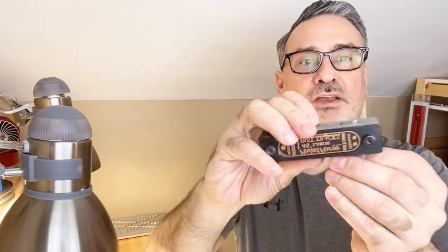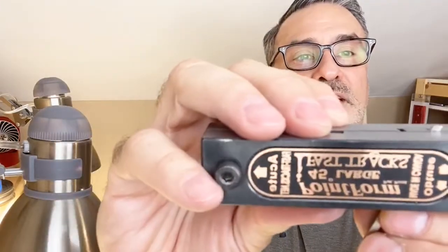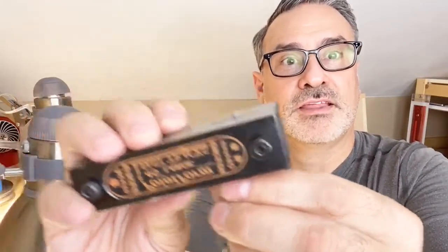The first tip I like to do is always file the longer angle first. It doesn't matter what angle crossing you're doing — file the longer angle first. Then it's a lot easier to file the secondary angle, which is a much shorter, more precise angle. When you put it back in the point form, it's a whole lot easier to just shave off a tiny little bit than to go through and file the longer angle again.